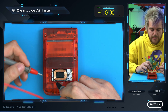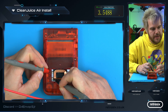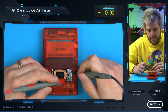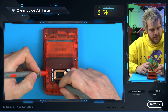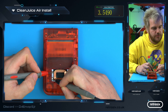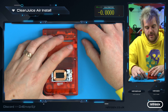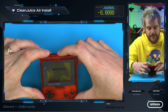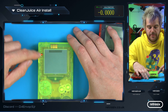Coming over to the output side, ground is the bottom and power to the console is the top. Here we're reading about 3.5 volts. Once the battery gets low, this would drop — so depending on the battery's charge state, it should be anywhere from 2.4 volts to 3.5 volts. When the battery is low, the power LED on the console will go dimmer. In this particular version we don't have a power LED, but on versions like this green one, the LED will simply dim.